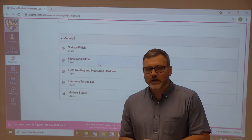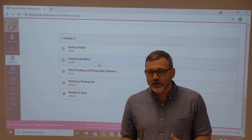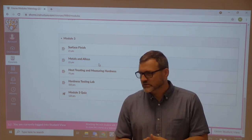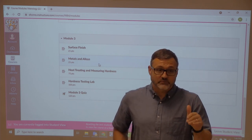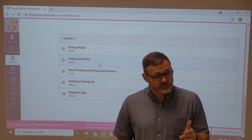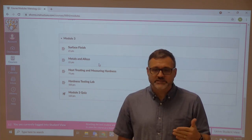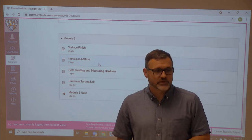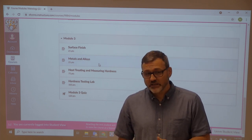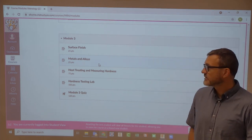Yeah. So oftentimes, smoother isn't always better. Certain things require a rougher finish. If you're going to glue a gasket to it, or something has to smash into it, or there's epoxy or a secondary operation. A lot of times we would say smoother is better, but smoother isn't always better. What the print says is what we are to go to. So if it says 63, 63 is what you go to. If it says 125, 125 is what you're shooting for. Now, if there is a way to lean, probably I'm going smoother is better. So if it calls out a 63 and I'm a 60, probably not too worried about it. If I'm an 80, probably a little more concerned about it. So knowing the application is beneficial.